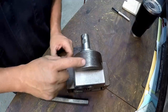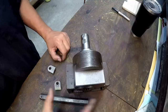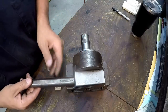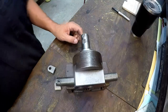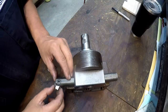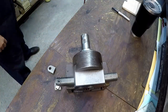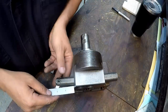But let's take this Criterion boring head right here. This is a 4-inch head, so this is a 4-inch diameter there. And we've got a 1-inch bar that fits in here like so. And we can put that in there. And we can take a 3/8 tool bit and put it in there like that. And then we can set this, drop my scale somewhere. We can set this tool bit accordingly to the length that we need,